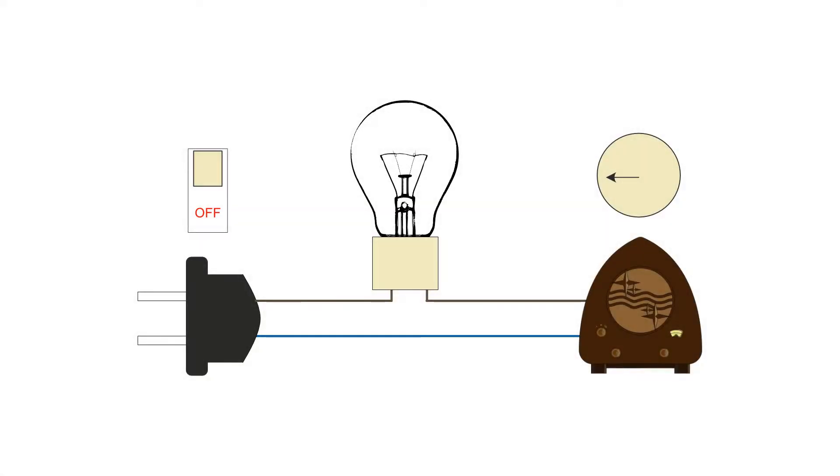The dim lamp current limiter is basically an incandescent bulb circuit — it must be an incandescent bulb. If we turn the device on to test it and it is not faulty, there will be a surge of current into the device until it reaches its normal working voltage; the lamp will briefly light and then extinguish or be very dimly lit. If the device under test has a short circuit, you can think of the device as a piece of wire in this lamp circuit. All the voltage will continue to be dropped across the lamp, the current will be limited by the lamp, the device will be protected, and we'll have a visual indication of a problem as the light will be on.